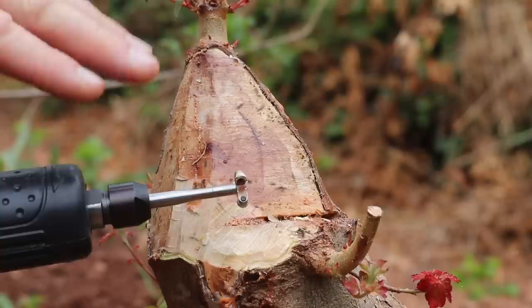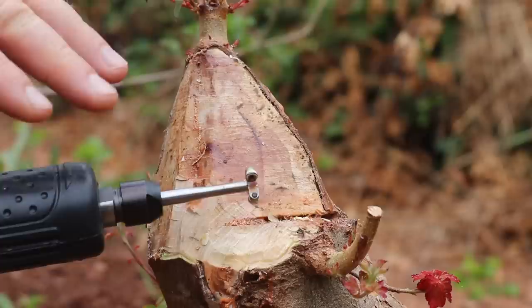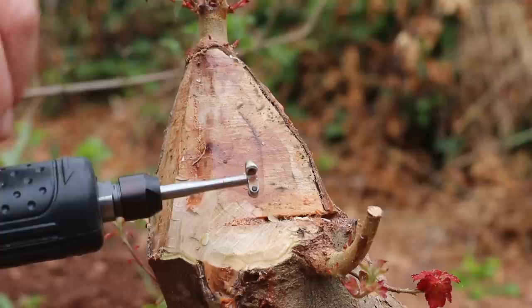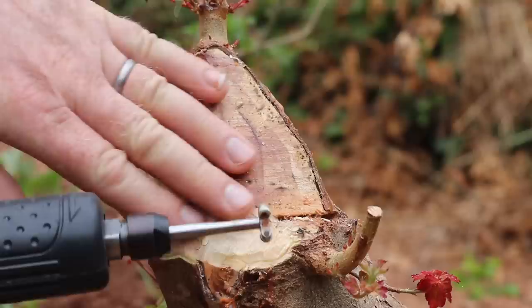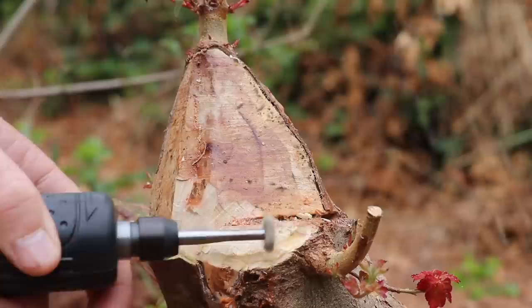Now I'm going to try the nibbler bit with the die grinder. What you'll see is that far smaller amounts of material are removed at a time. It's very controllable and virtually effortless because the machine does all the work, so you can be very gentle and take off very little material at a time — allowing you to shape the cut very sensitively.